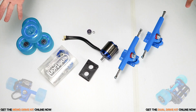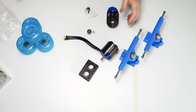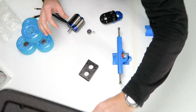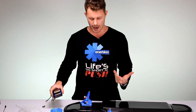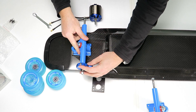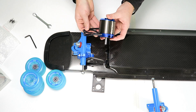Okay, let's assemble the drivetrain firstly. We'll start with the motor. So you've got your motor mount — just want to make sure you get the orientation correct. You can mock it up on your board if you want and work out where everything's going to go. The truck is going to go on there. Work out what side you want the motor on — you probably want the motor on your heel side. Think about how you're going to stand on the deck before you go ahead and build it. Loosen up these ones a little bit, just enough to slide it on. Now you want the wires coming out the back and then back around.